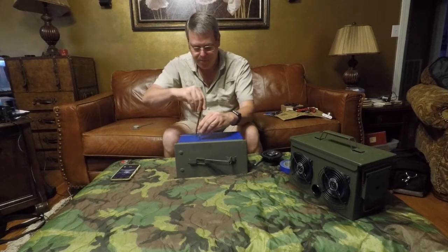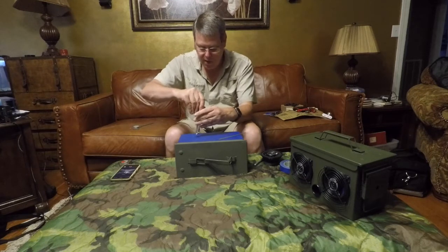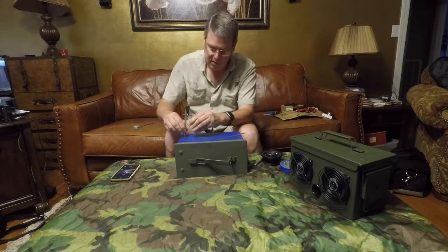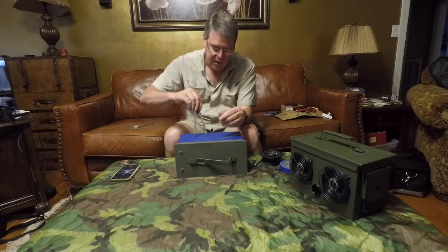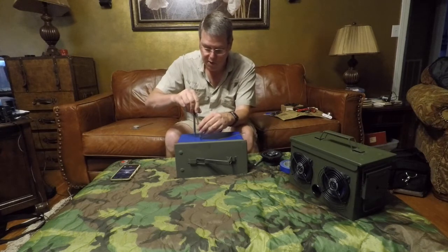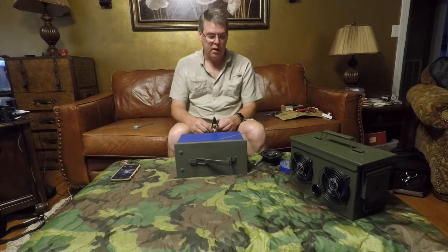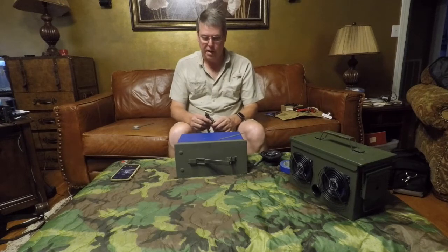when I'm cutting my holes. And you're probably asking, how do I cut these holes? They're too big for a drill. That will be our next part of the build. And what I use is a regular jigsaw like you would use for woodworking. And they sell a metal cutting jigsaw blade. DeWalt sells them. The brand I use is DeWalt. You can find them at Lowe's or Home Depot. Harbor Freight, I saw them the other day, they had some metal cutting saw blades for jigsaw.